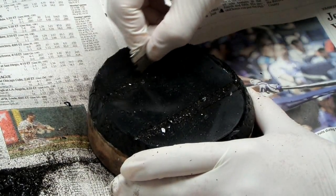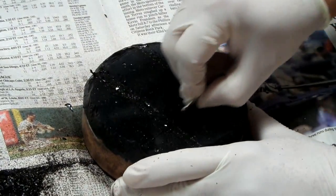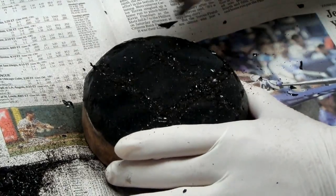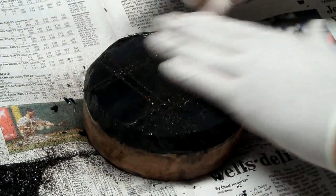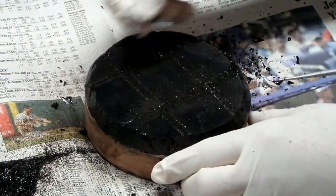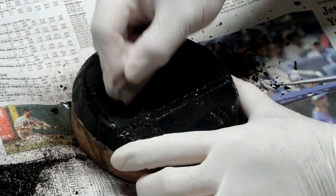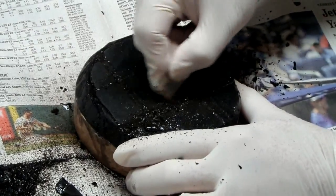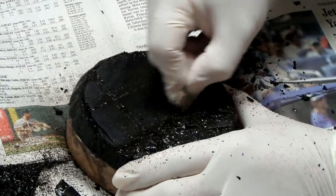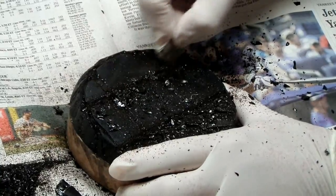On my pitch polishers I never worry about them being regular or perfect in any way. I've now laid a grid pattern on there and broken through the first layer of pitch. Now you basically just go over it again, this time put a little pressure on it and dig in a little bit to deepen out those channels and make facets.